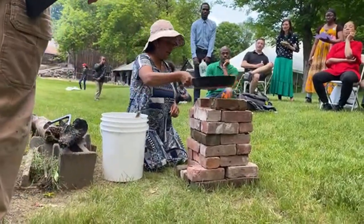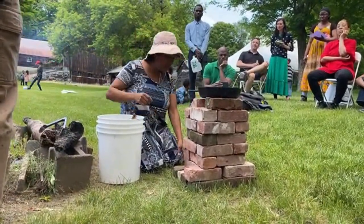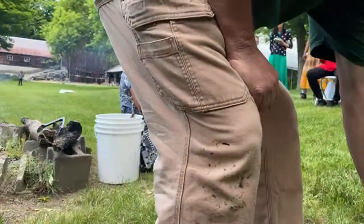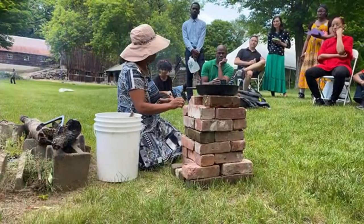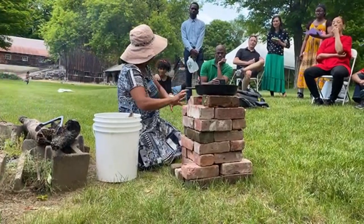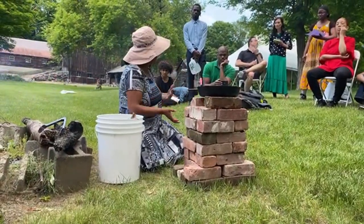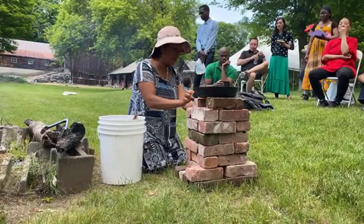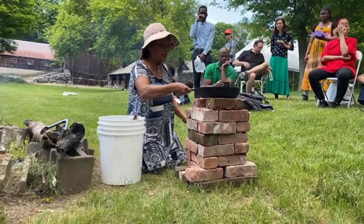You have to watch your flame, you have to keep feeding it. In the back you have a little hole — you have to keep cleaning it because they actually accumulate and you need to make the fire breathe. So remember this goes this way because my brick is here — I don't want it to get hot if I put it here.